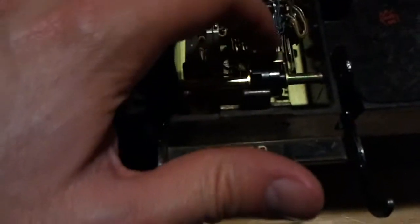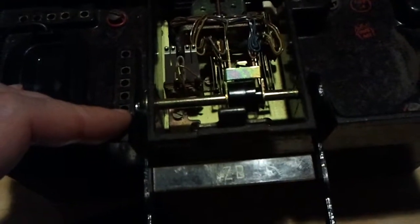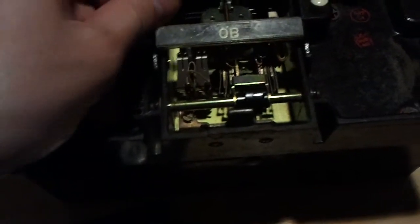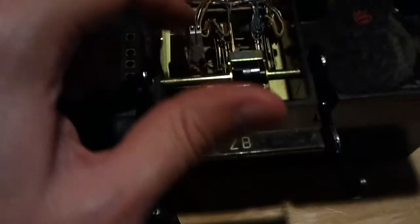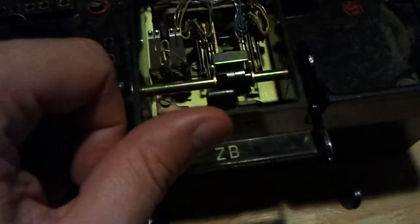If you notice the switches are not coming out of contact, you may have to get in there with a small screwdriver and apply a little pressure to bend the contacts so they work again. You can put OxGuard on the plates that come in contact with these, but do not put anything on these switches or it will cause problems.